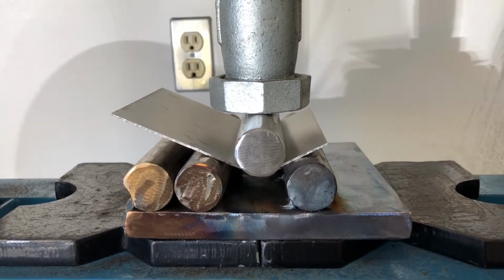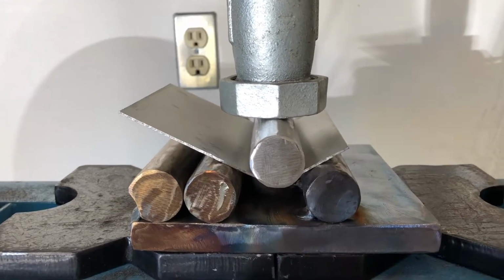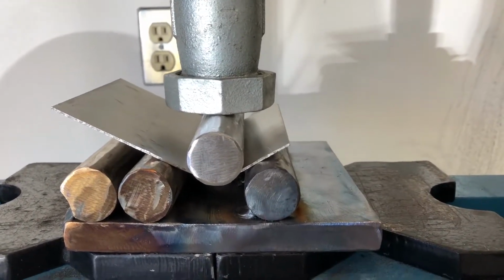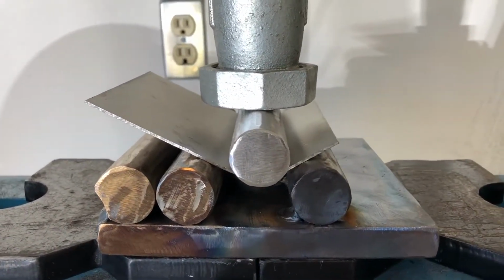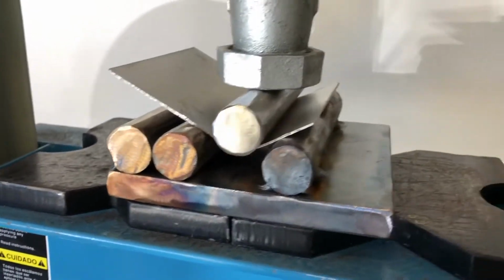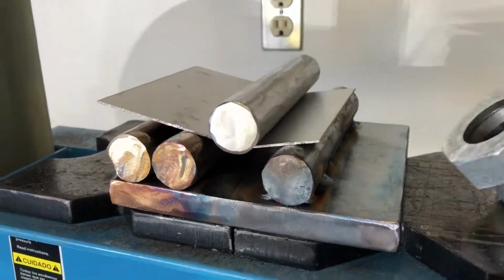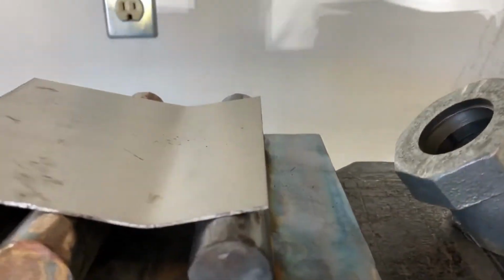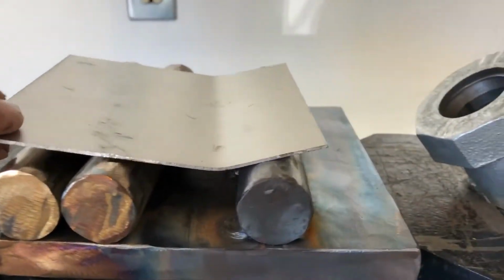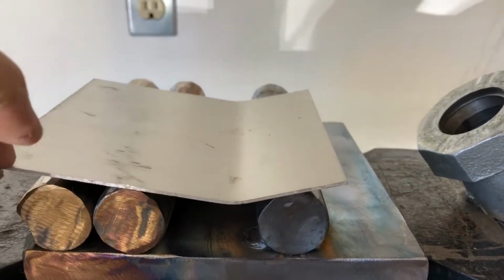And in this case, that titanium is really hot because I'm putting it on a fixture that I just welded, so it's really hot. So I could try this bend and see what I get there. I'll leave the camera running. This alloy of titanium really wants to spring back into the shape that it was to begin with. So I can work with that. I can definitely work with that.